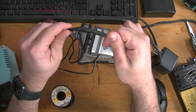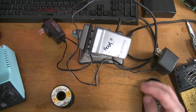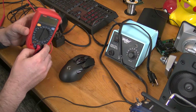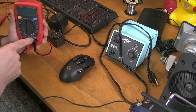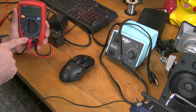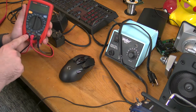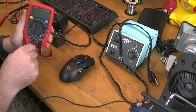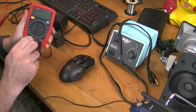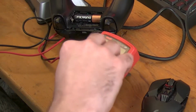One thing I should have done is plugged everything in and tested it, but what fun is that? One thing I forgot to mention, and I've never actually been taught properly, is that common is supposed to be the ground, and then the other port is usually the other probe on a multimeter. Apparently the 10 amp one is for when you're measuring larger currents, so it's fused and you don't fry everything and mess everything up.